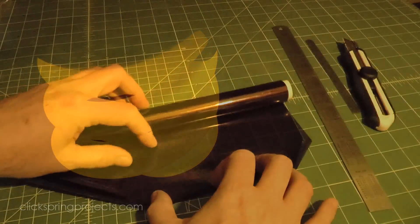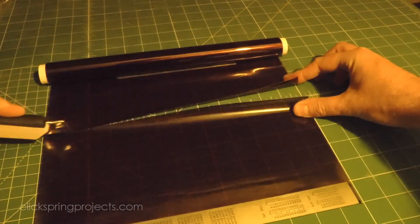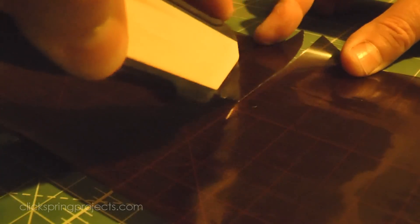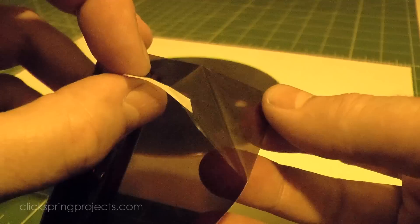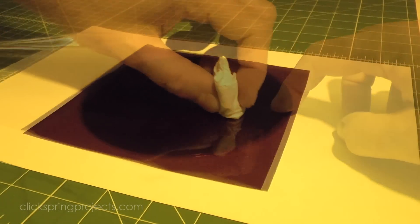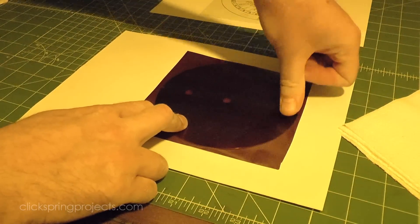Another variable in the process is the quality of the resist film. There are many places to source it online, and it does come in various grades, but there's usually no way to confirm exactly what you're getting prior to purchase. So if you're trying a new supply of film, be sure to test it out thoroughly before committing the workpiece. Bubbles and dust particles are the main issue to address at this point. I tend to use a sweeping motion as I work the surface out to the perimeter, and if I see a blemish that can't be solved by simply lifting the film and trying again, then I take the whole sheet off and start again with a fresh piece. Any flaw in the bonded film at this point can only cause problems later on.